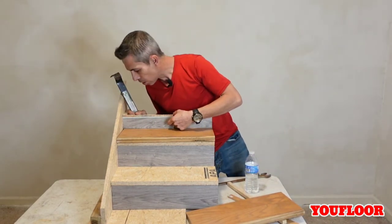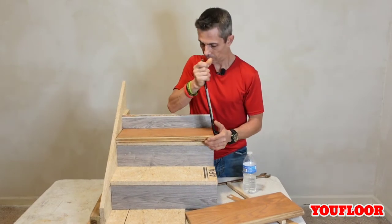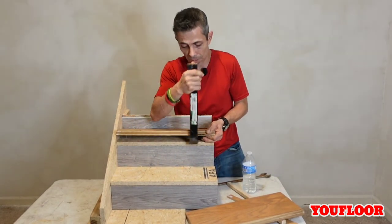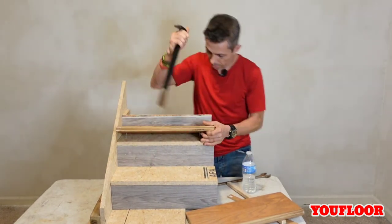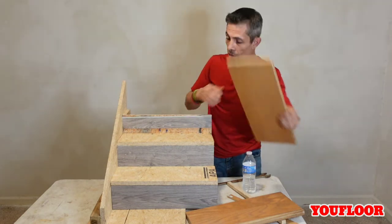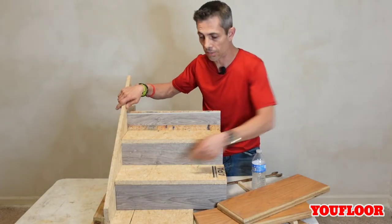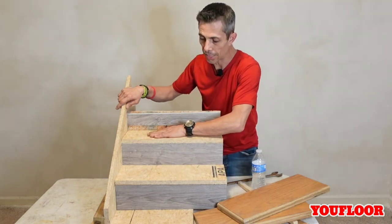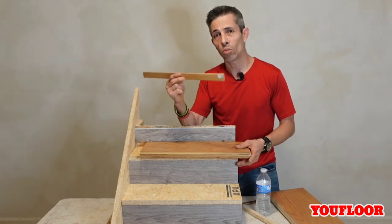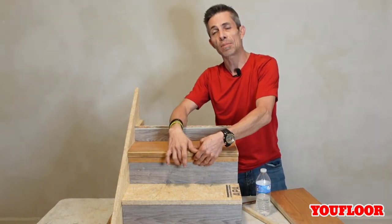I've set this on top of this, so we're in that situation. A lot of these I glue and nail, so if you've got to take mine off, you've got problems because I've built them to stay. I was able to slip that out from underneath this riser right here — you're just going to be lucky if that happens to you. Now you can see it's flush with this riser. Draw your line right there, cut them off, and this is what it would look like. Even still, you're going to be left with this raw wood, so the best bet is to find some raw wood, stain it the same color as the new treads, and cap over that raw wood.